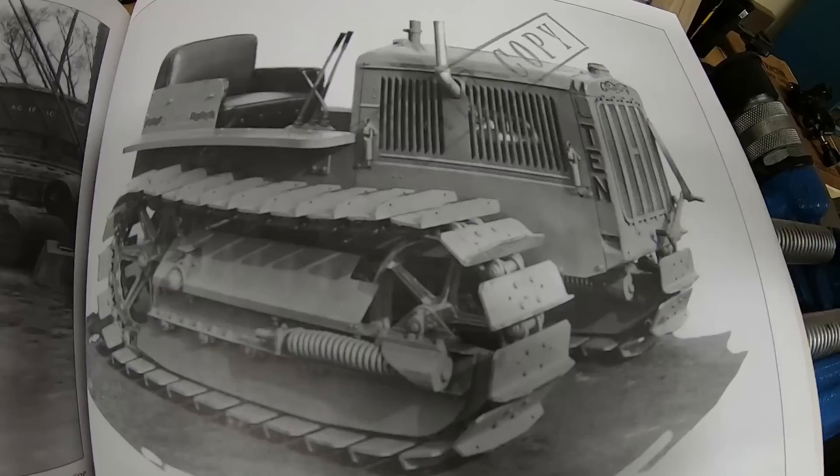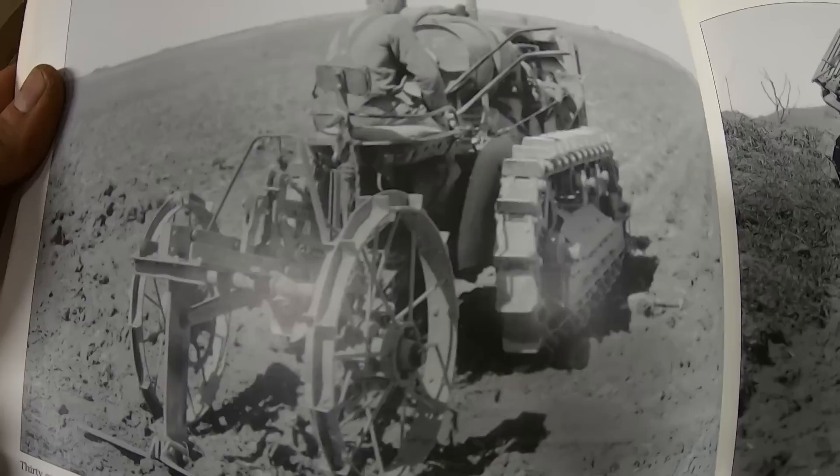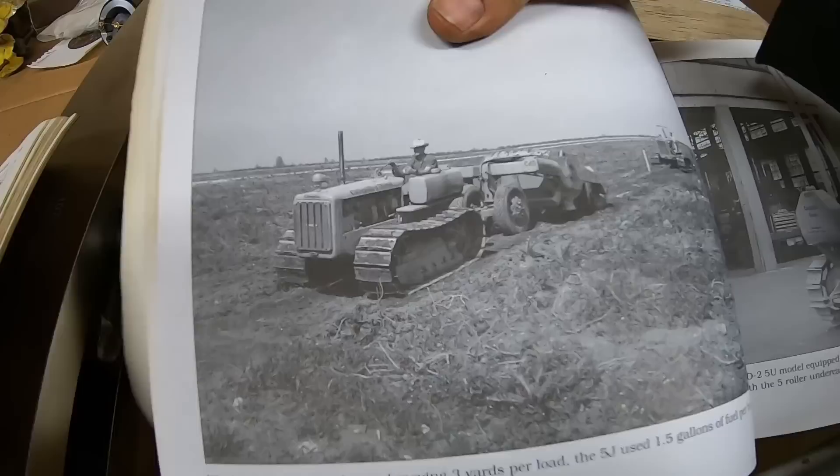Going back to the skeleton shoe in the D2 manual, here's another Diesel 75 equipped with similar skeleton shoes — as you can see from the picture, with no other attachments there is not much there on that track chain. Here's a Cat 10 outfitted for winter work, equipped with skeleton shoes and what looks like ice grouser attachment cleats going all the way around. And here's a Cat 10 with bolt-on street plates over the grousers, and another Cat 10 with wide angle shoes similar to that R2 we saw.